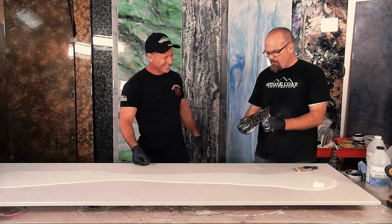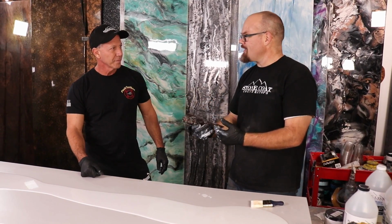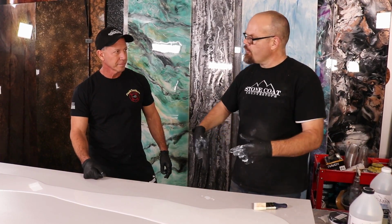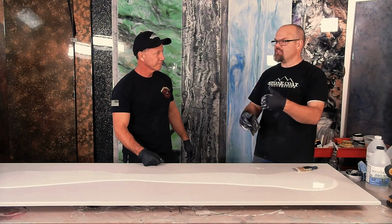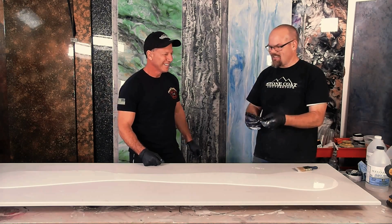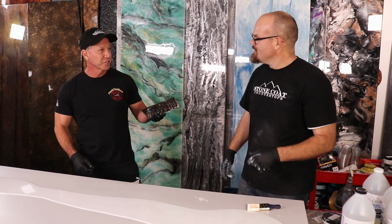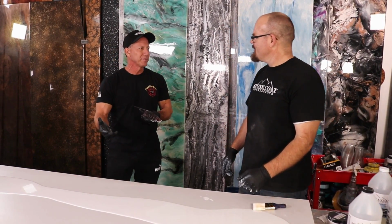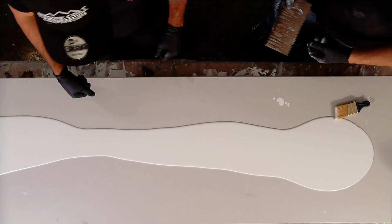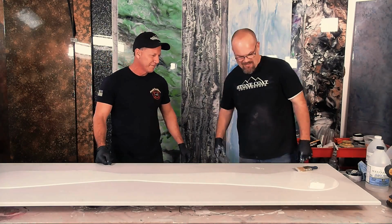Cool. People can buy a square notch trowel at Home Depot, same price, but they have a hard time finding the 1/8 square. It's made for floor adhesive, so it's in a different section than the tile. They're looking all over. I had people asking me for it, and I have to tell them where, but I did not know that you had yours bent for that, so I can explain it to people sometimes. Sure. And this is perfect. It's a little gauge, and it drips. Anything that makes things easier is better.